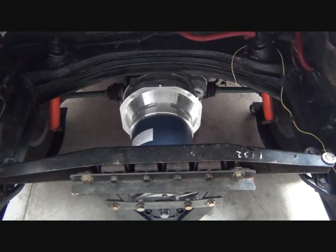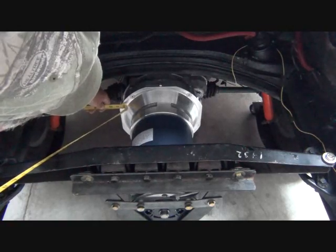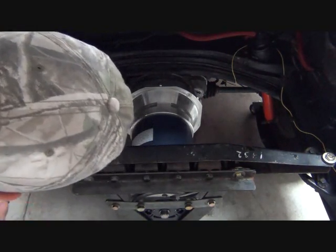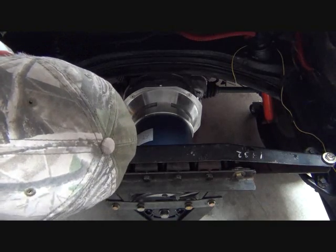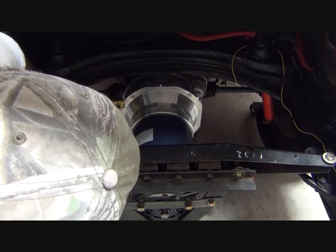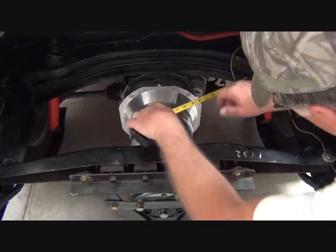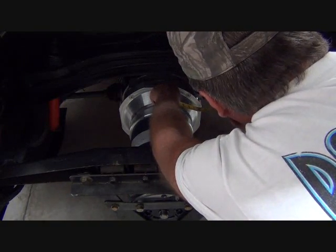If we can squeeze the width — 11 and three-quarters — there's 12 right there, bringing us right up just beyond the gasket. At the edge of the gasket we're at 11 and a half, so that's 12. It looks like we'll clear, but it's going to be tight. Checking the other side — looks the same.